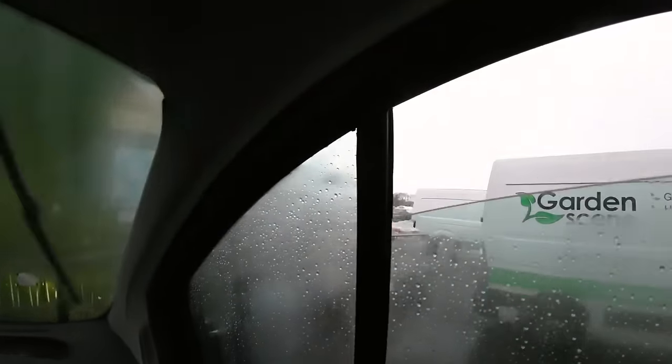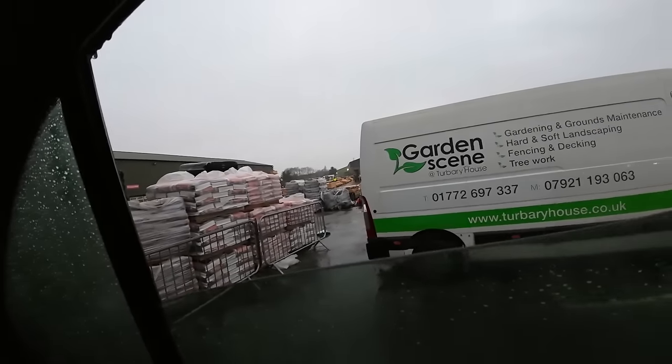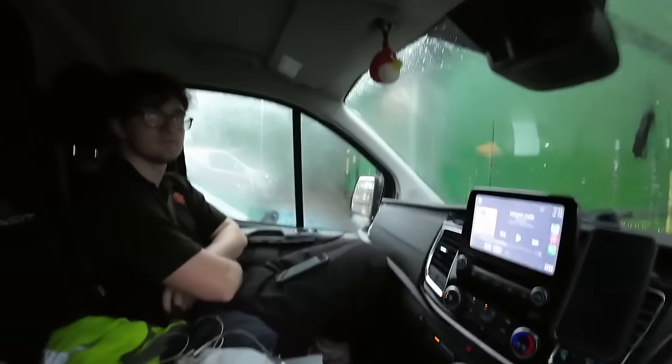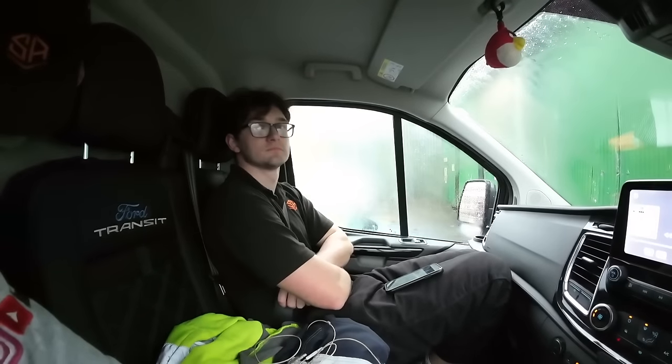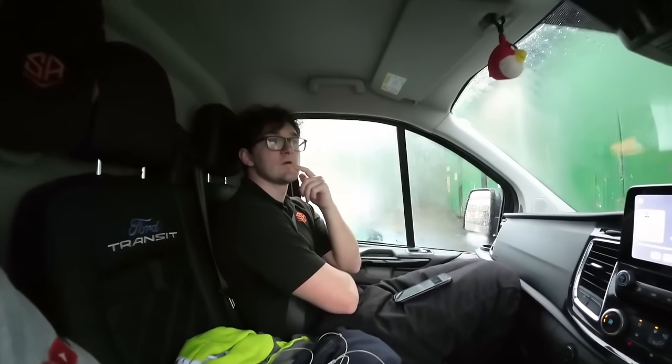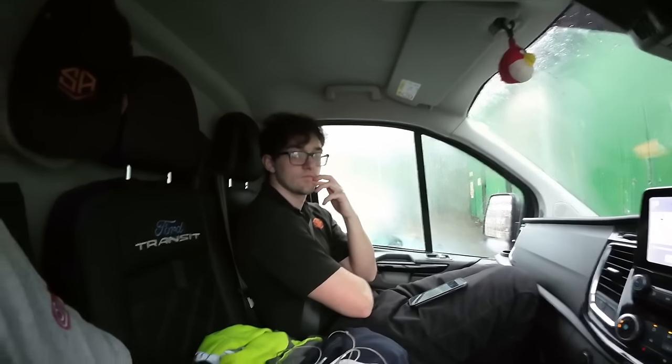Currently sorted out the materials with the customer, but we've been up to Berries, as you can see. Well, you can't really see very well. And Berries is always quite busy on a rainy day. People come and get the supplies in. So we've been up for insulation because we like the ISO stuff. When we use the thin stuff, there's only going to be a 50mm cavity on this porch because porches don't come under building regs. So it's a thin cavity, so we come to get the thin insulation, and we've got the visqueen. And while we're here, we always go in the shop.